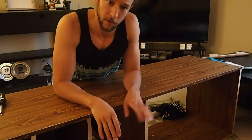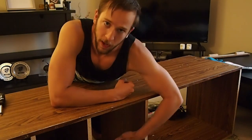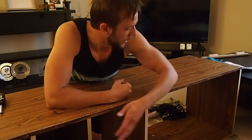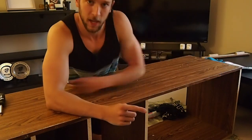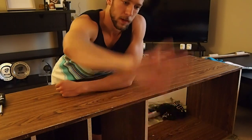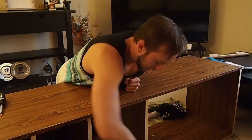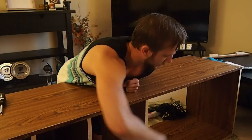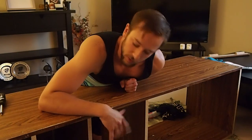Before I remove the shelf, let me do a quick rundown of the plan. Once the shelf is removed, I'm going to add a new backing — a quarter-inch piece of hardboard that I'll glue and screw to the back. Then on the inside we're going to silicone all the seams, lay vinyl floor on the bottom and the back, silicone that down, add a runner board across the bottom, and then throw sliding glass doors on it. Fairly straightforward.